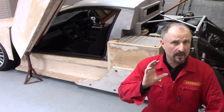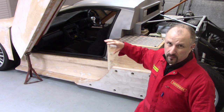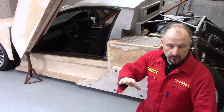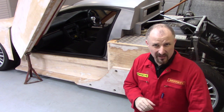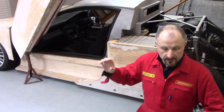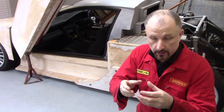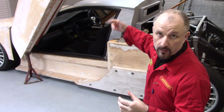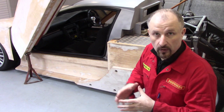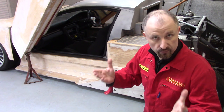I don't have many pictures of when I was making the door opening — it's very labour intensive with loads of measuring, checking, and double checking. But I do have a couple of pictures. The process of building this car involves making two identical pieces of metalwork and applying them to both sides. If they fit, I know the car is still true and everything's lined up correctly. If one side doesn't fit, I know I've got a problem somewhere.